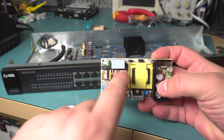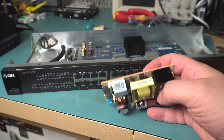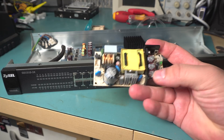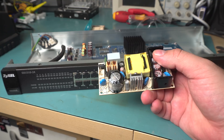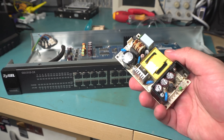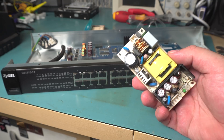There's another capacitor in there I'm going to investigate too — it might need replacing. It looks okay now, but I'm going to replace it anyway. This is just a 12V 3A output power supply — a fairly standard issue. But all their power supplies use these cheap caps, even in the newer ones, although my newer one looks like it's in good shape right now.